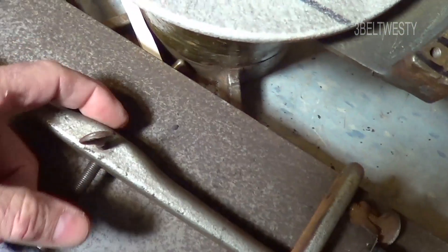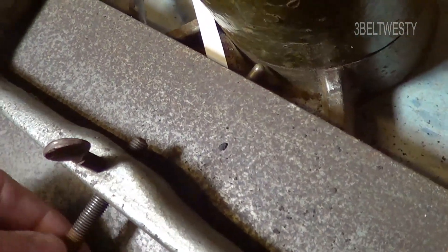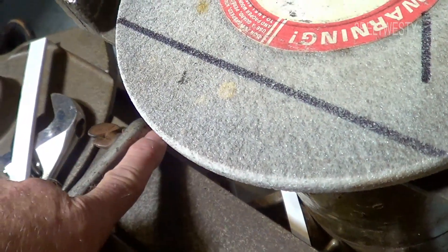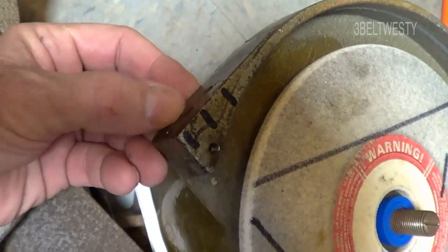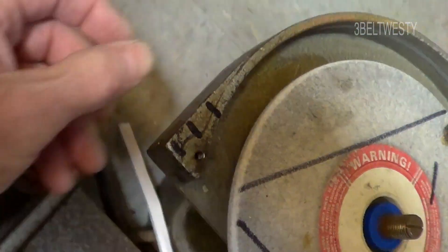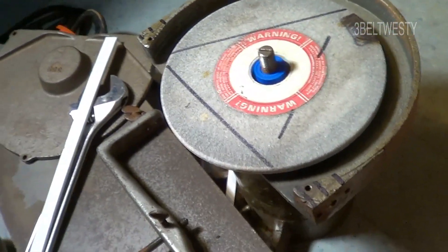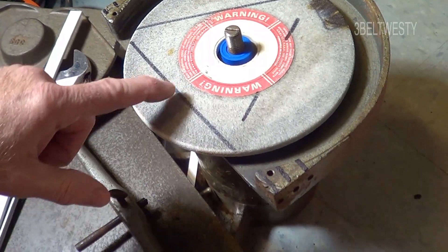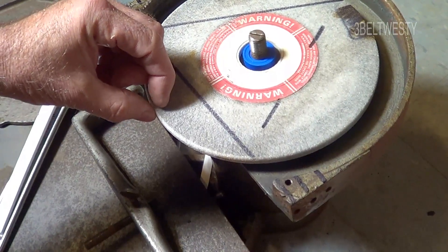You can move the pivots to two different places here, and you have three different ones on this side, so you have six different combinations. But the way this works is: to get a tight radius of curvature you need to have the pivot points close inside the disc.